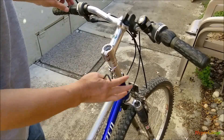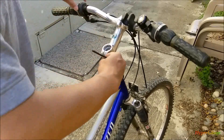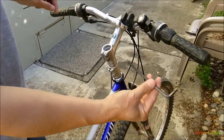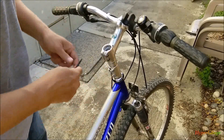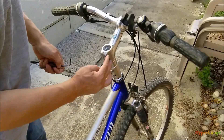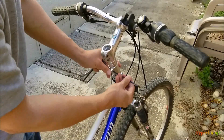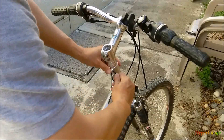With both sides of the bolts put in place, you can tighten them slowly. At this point it's still loose but the bolt is already in, so it's not easy to take this out anymore. Now you want to tighten them down. When you tighten down these bolts, do one set at a time - you want to alternate: low, high, low, high. This will ensure you have a very good grip.